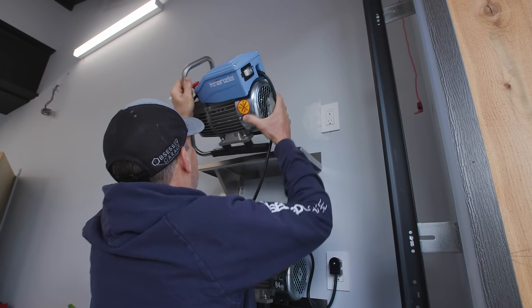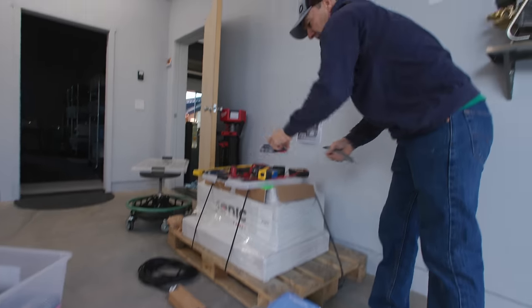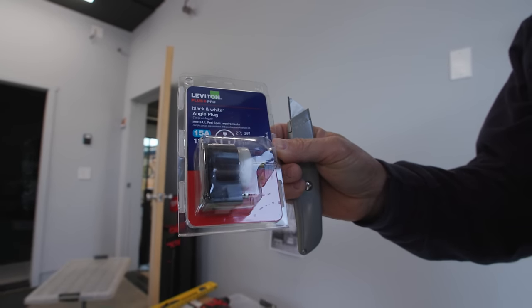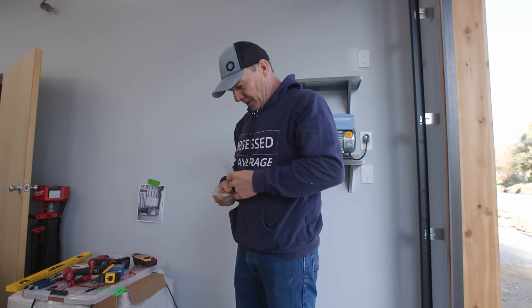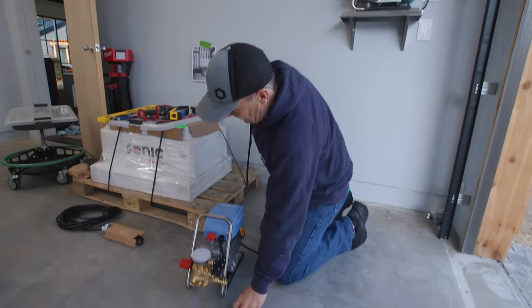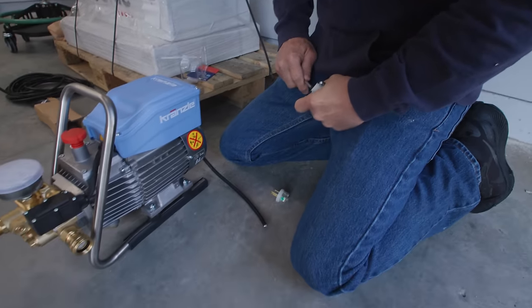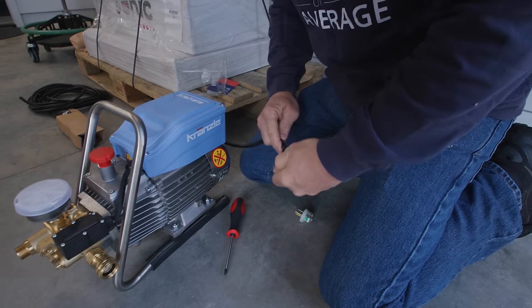So, all right, let's get this down. So what I use are right angle plugs. So I buy these. Let's get in close for the people. These are actually Home Depot. Okay, we'll have to buy them at Home Depot. Leviton makes them for everybody else too. So while we do have a 20 amp dedicated, there's really only a 15 amp plug on these. So this is open up the strain relief. There it is. So first get the cord in there.